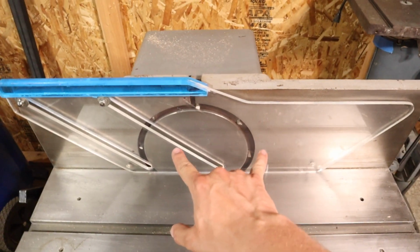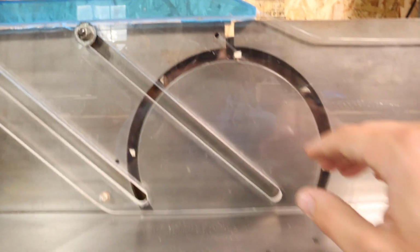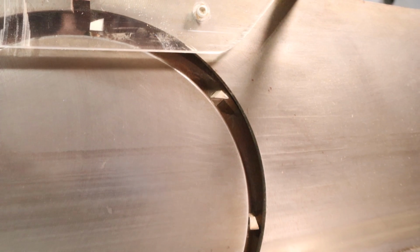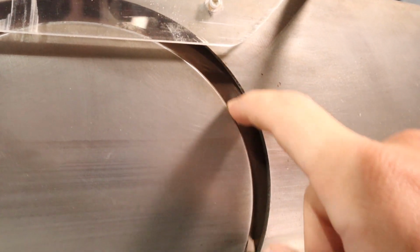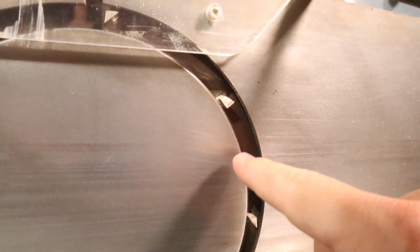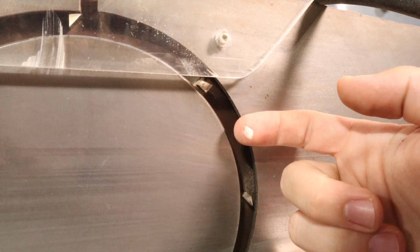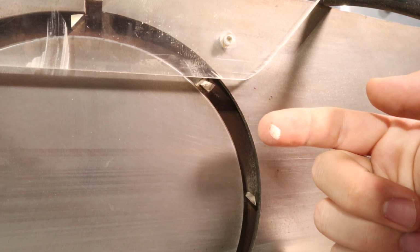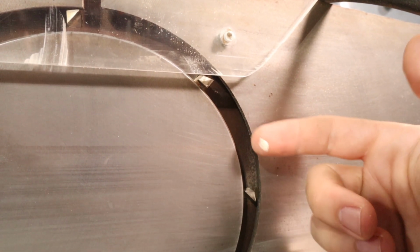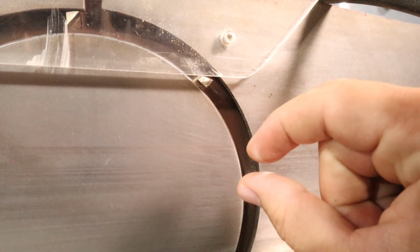Except on the Uniplane, rather than having a single cutting blade, there's kind of a triple cutting action. So if you'll look inside here, there are actually 2 different types of these cutter heads. Let me see if I can get a closer look. I don't think I'm going to be able to adequately capture it on camera, but every single one of these cutter heads is slightly different from each other. You've got rough cutters and fine cutters, and what happens is, as your workpiece comes in through here, your rough cutters are sticking out about 2 thou further than your fine cutters, and they will take off the first pass, take off the vast majority of your workpiece, and then your fine cutters come through just a hair afterwards and take off the last 2 thou that you have right there.